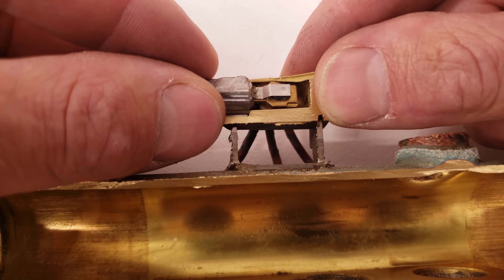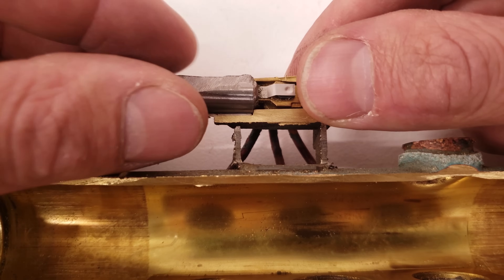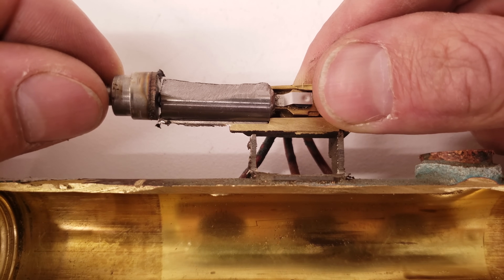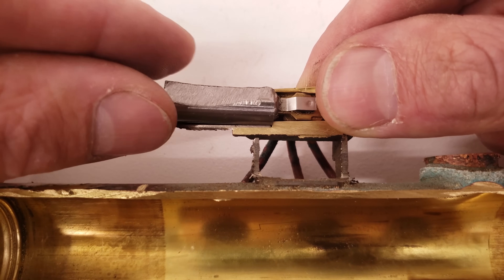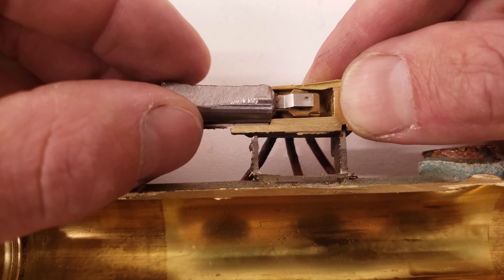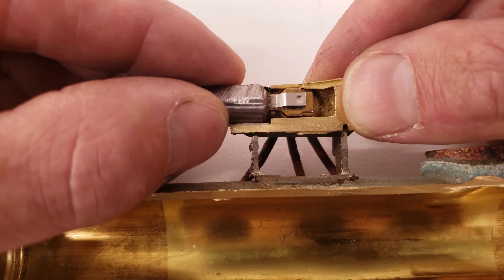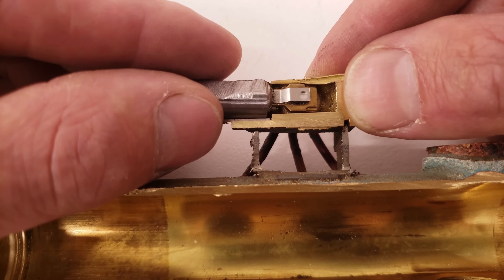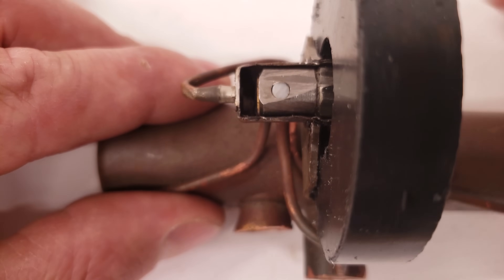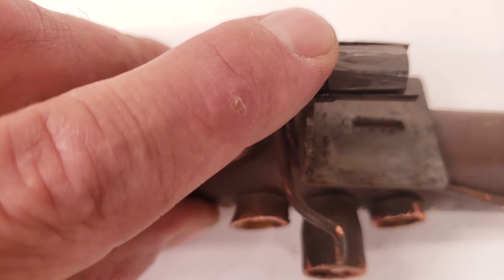You have this little spring applying force downwards to hold that rubber insert in place. On the side there's a spring up against the end, so you have this iron core sitting inside of a stainless steel shell with a spring on the back. In the off position this is going to be forward, and when you're powering the electrical solenoid, you're pulling the iron core back this way and connecting the center and the left-hand side tubes. Sometimes these inserts are not rubber but Teflon instead, and we have a magnet here just to show the sliding of the iron core on the inside.